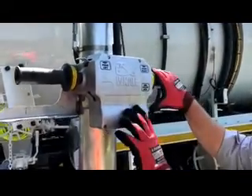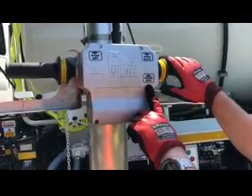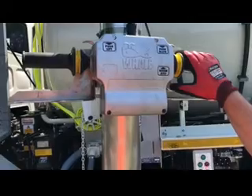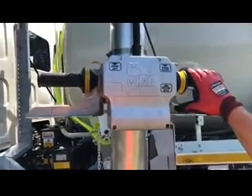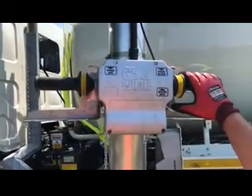The two triggers on this side — boom jets we've already talked about. If I push that lever up now, I'm not going to do it because the jet pump would start straight away and the jets would start coming out at the bottom of the boom. So that's your boom jets, to clean in the gully and the sides of the gully.